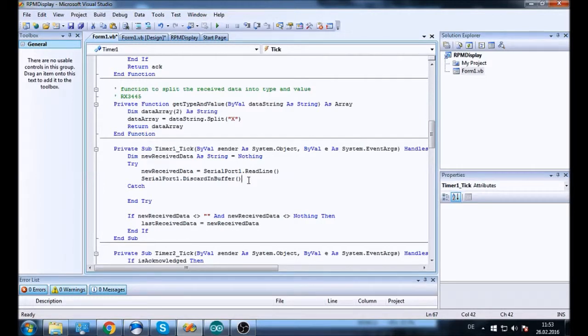And sometimes if the Windows CE device has a problem catching up, it gets even slower, and then the input buffer gets even larger, and this is just a chain reaction. So each time we read, we just delete everything else. Basically we read the oldest entry in the buffer and delete all the new entries, which isn't ideal, but it works, since it runs often enough that even the oldest value isn't so old that we could notice a difference.